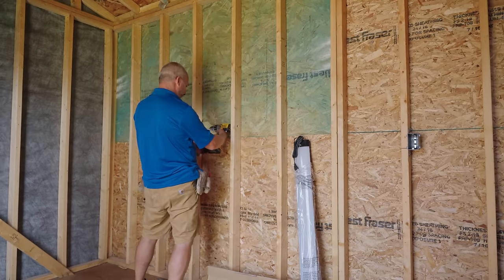All right, so, for simplicity, make sure all our wires are the same length. And again, we're going to strip them. Okay, so we've got the numbers relating to the gauge of the wire. 16 is not even household wire, it's like lamp wire. 14 is minimum household, 12 gauge in a lot of cases, 10 and 8, thicker wires for different reasons, stoves and that sort of thing, right?